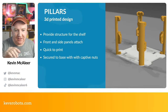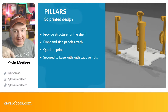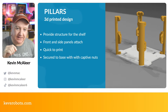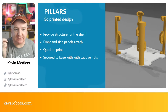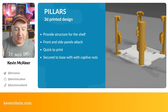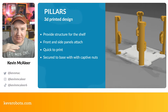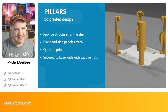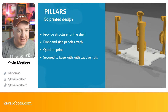There's a bottom section with screws, a top section, and a shelf that goes onto the middle section — which is what the lidar sits on top of. The shelf was designed to have the lidar just peeping out the top of the robot's head, because we need a completely 360-degree, clear, unobstructed view for the lidar to spin around. This also allows us to attach the side panels and front panels to the robot. They're quick to print — best printed as a tall structure rather than lengthways.